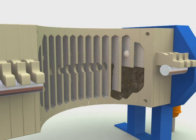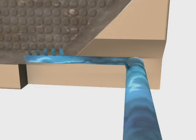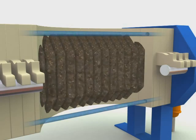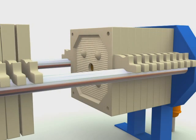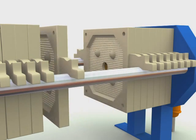Slurry is pumped into the chamber against the filter media. Liquid passes through the filter cloth and exits through the filtration ports of the filter plate. The solids collect on the surface of the media within the chambers until the chamber is full. The cake may be washed or blown dry if necessary. Filter cakes are then discharged and the filtration cycle is complete.